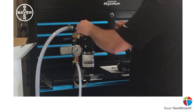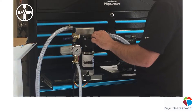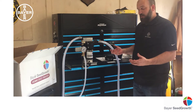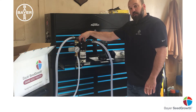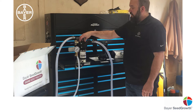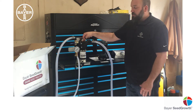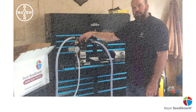Put the four screws back in and tighten them up. This is a clean one so there's no mess, but it's a very cost-effective way to essentially give yourself a brand new pump. The most common issue is improper storage — leaving it somewhere it can freeze will give you trouble. So if you're having trouble with your pump running but not pumping, it's likely your diaphragm.